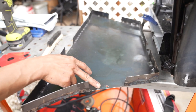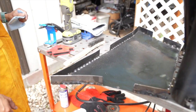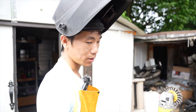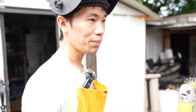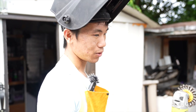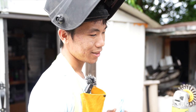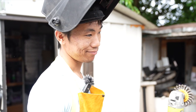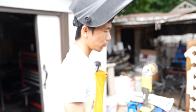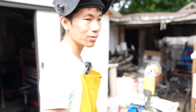I've got to add more bead every half inch to an inch all around it — it's going to be strong, and then I'll polish it when it's done. How much time have you spent so far? Last Sunday, that's just one panel alone, I spent almost a whole day to finish it. It takes time, but it came out nice — it looks great. So I'm going to add more tack weld around the inside and polish it off afterwards when I get another chance.